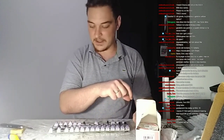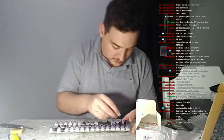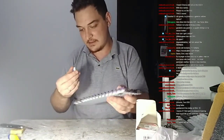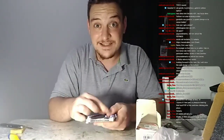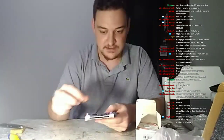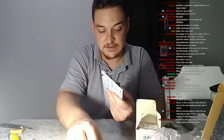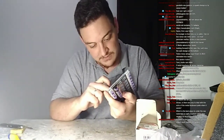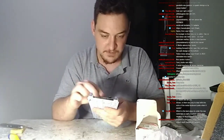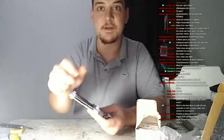So what I'm going to do is place a row and solder every row very quickly. You guys at home, especially the dudes that are doing this for the first time, take your time soldering because it's quite definitive. Desoldering is not a really nice shenanigan, it's not pleasant, and sometimes you can break your PCB, you can lift pads and whatnot, so be very wary of the solder joints, be very wary of the place you solder your switches, because once you do that, it's pretty much definitive, so please be calm and patient there.